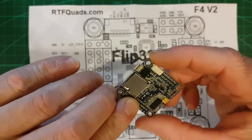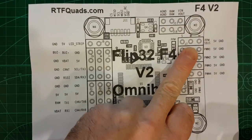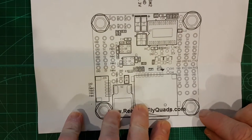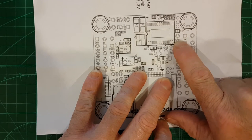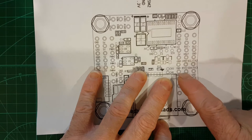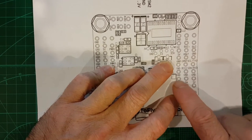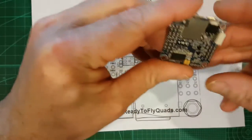The only thing I've noticed that might be a bit of an issue is some of these pins are labelled wrong — not over here. This top section here is labelled correctly. But if you have a look at this bottom section here, some of these pins are wrong. Like for instance, the ground here is actually the LED, and the ground is on the outside. Also over here, these are wrong. Normally ground is always on the outside pins, except for these pins here where all three of them are ground. So they're actually mislabelled on the board.